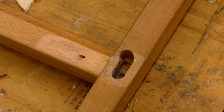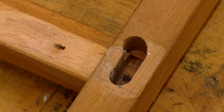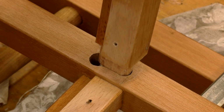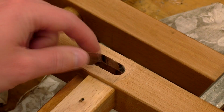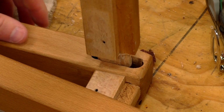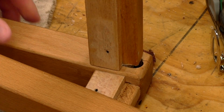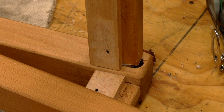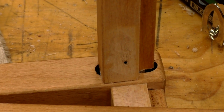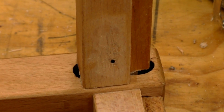With all of the parts disassembled, this is where I found some problems. Some of the mortises were cut really badly, like here where it looks like someone slipped with the router at the end of the cut. And here where I really don't know what happened, but the mortice was much longer than the tenon. I couldn't quite believe that whoever made these chairs left the joinery like this without either remaking the pieces or at least plugging the gaps with some wood. And I knew I'd need to find a way to sort this problem, which I'll get around to later on in the project.